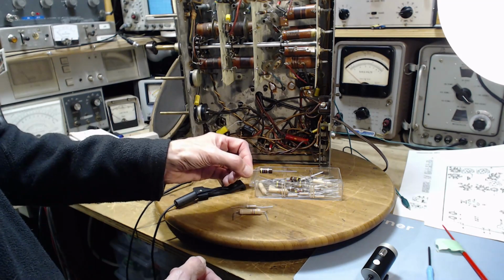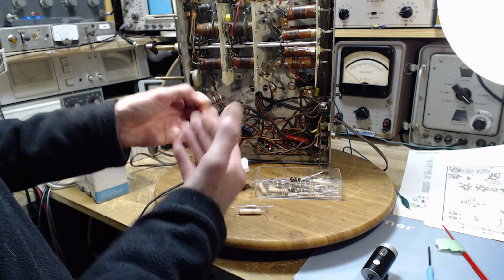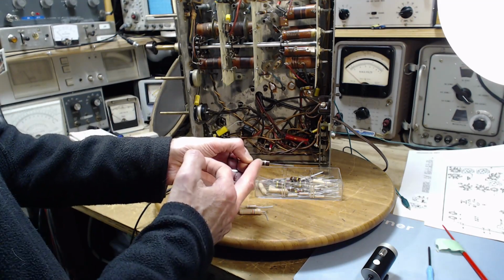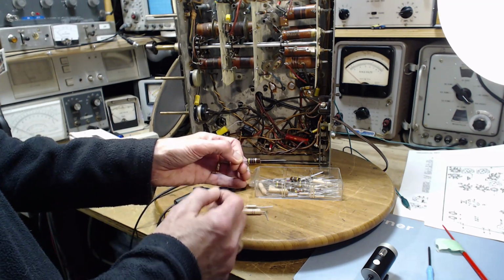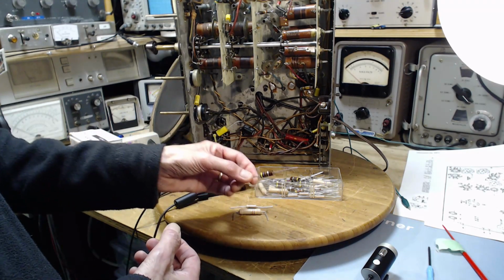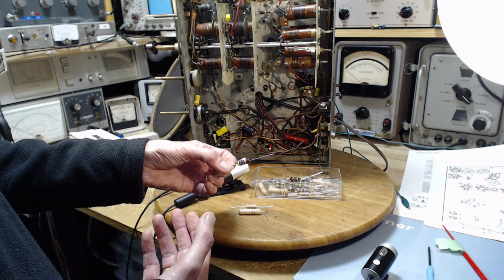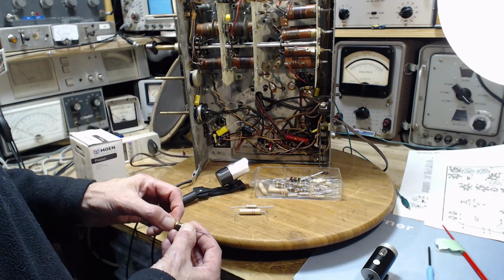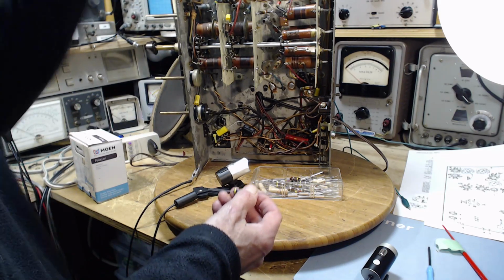It's possible in the factory when they built these that their systems were running a little bit off and they were producing these resistors at the value I measured it, but it's still okay to label them as 470 and stick a silver band on them. I don't really know for sure what's going on in those factories or what was going on back then. These guys will go high over time. My own personal experience is they never go down, they always go up, and that sitting in a tray here doesn't cause them to drift over time. So that's been my experience. Now others have other experiences.